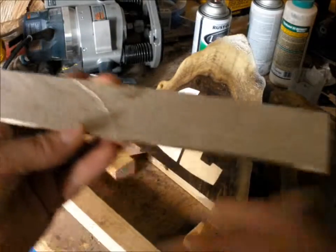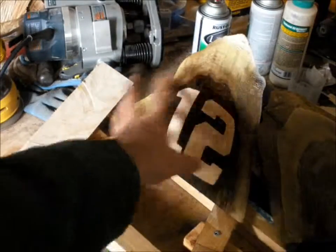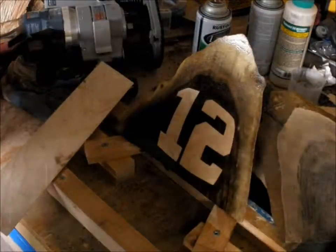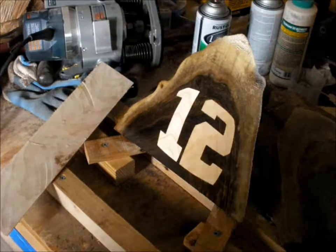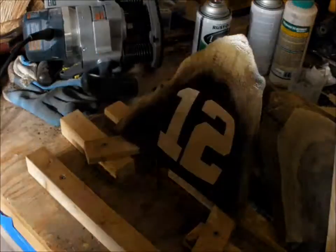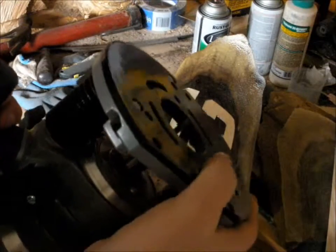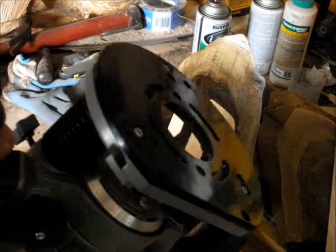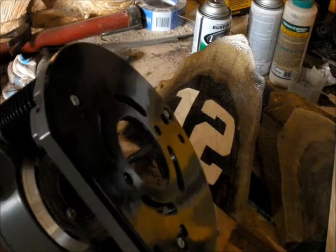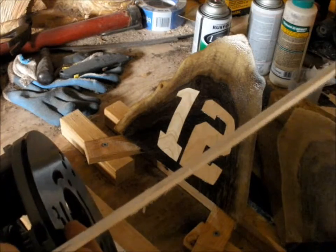If you really have to cut on that side, set the table back to straight first. You want to start with your work piece being flat — sand it down using an orbital sander, which makes quick work of getting it flat. Then to cut the corresponding grooves in the work piece, I use a router with a quarter inch straight bit, though there are lots of other bits you can use. I set the depth to be approximately the thickness of the inlay piece.